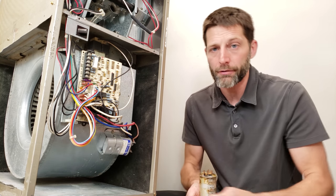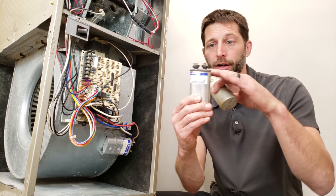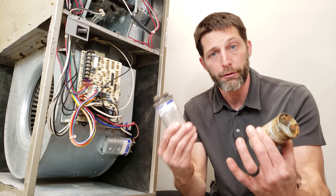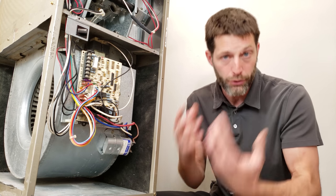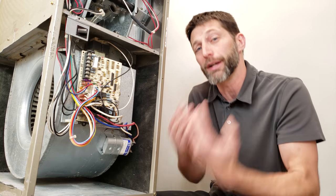This is where it's mounted right here, but you can quickly tell if it's bad just if you see a mushrooming effect on the top or on the sides. This one's leaking fluid, so these would automatically get replaced. You really don't want to wait that long to replace a capacitor — even though it's still running, you don't want the blower motor to suffer damage due to overheating.